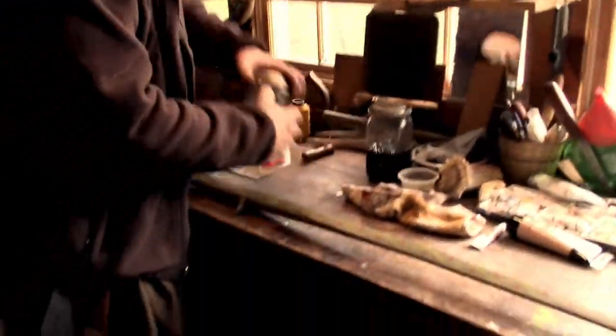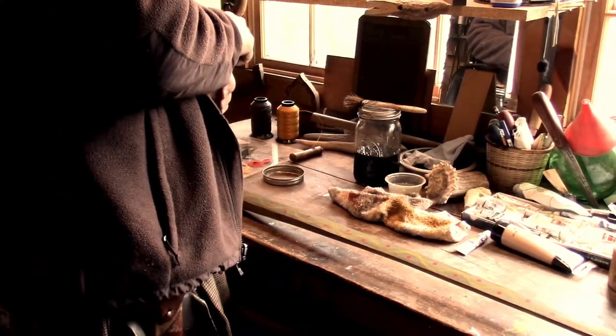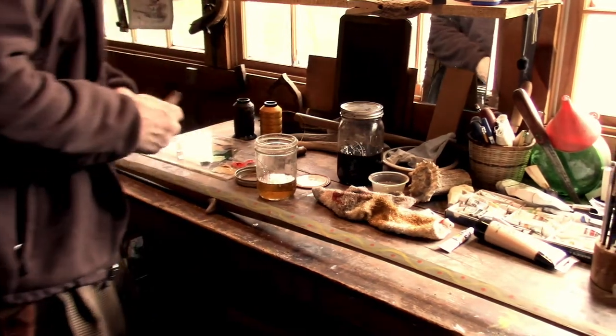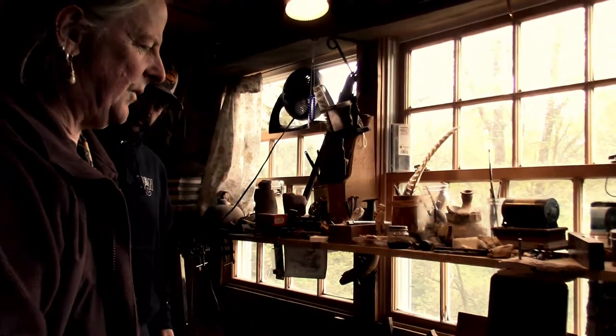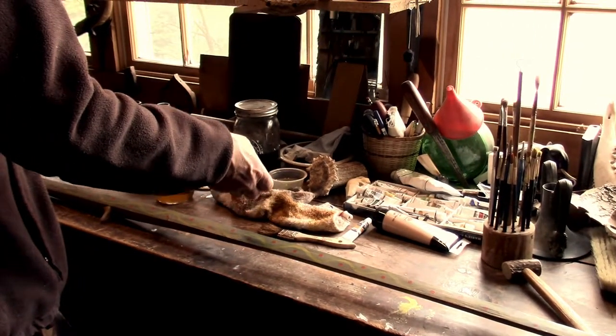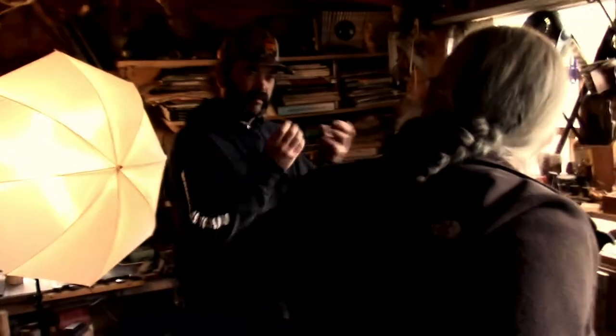This is linseed oil — it has some turpentine in it, not a lot at this point because I've added oil to it. Is this the raw or boiled? This is boiled. Boiled linseed oil will harden, and raw linseed oil tends to turn things black. I've had issues with linseed oil and black mold — not huge, but like when I do anything that's going to get slightly damp, I'll get like this black trace of it. It's like a black mold.